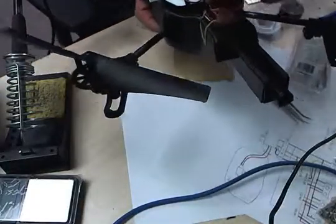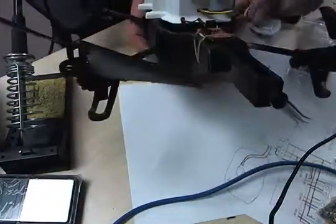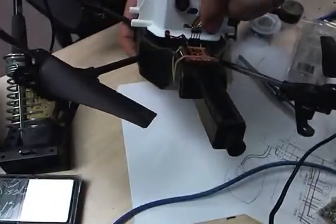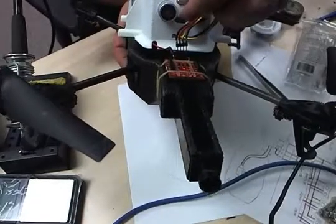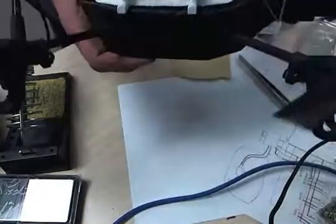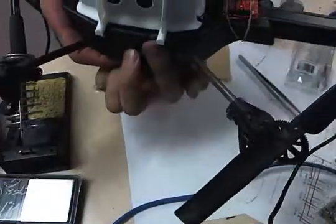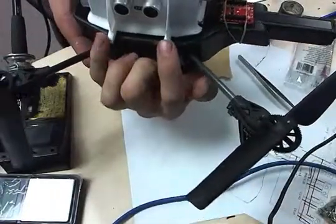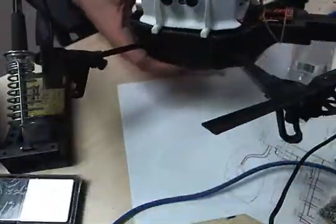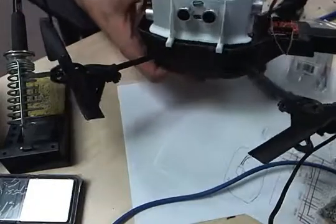And then these guys, this wire header plugs into the XP, and you put ground next to the ground pin that we already connected, so it'll go in this order. Plug that guy in, and then to attach the thing, you just grab a couple of rubber bands from these two points, stretch them around and underneath, and hook them to the points on the other side, and that'll hold everything together. And that does it for the hardware on the Parrot.